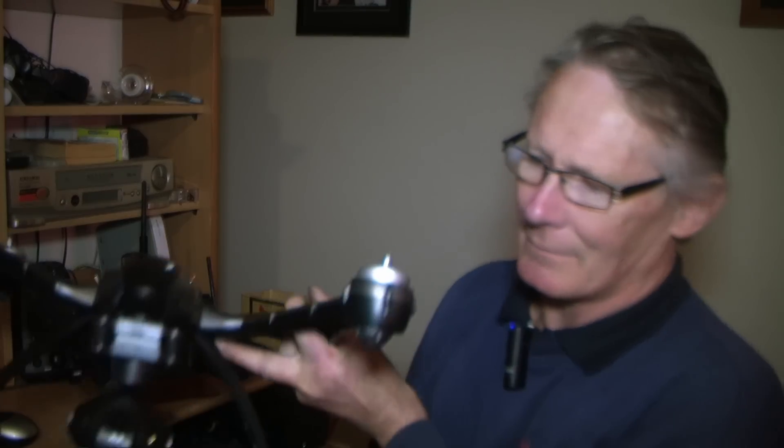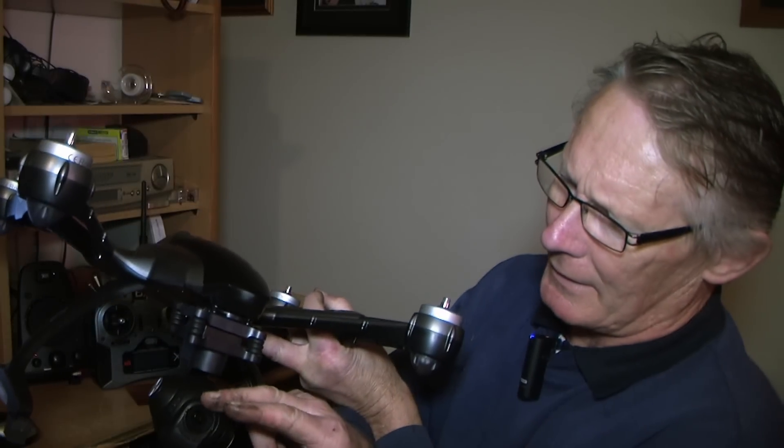You'll see the little LED on the camera start blinking, and then after about a minute or two, the camera will turn off. Now, if you've got the ground station running, you'll see that it does give video link, but then freezes, because the camera actually turns off. Even though the bird's still running, the camera turns off. I left it for about a minute, and then I rebooted. No problem. Sorted.